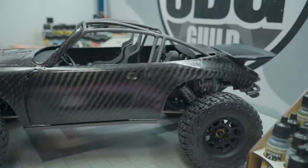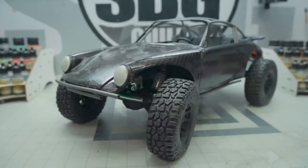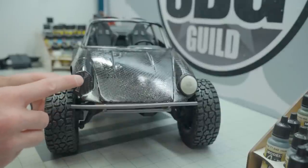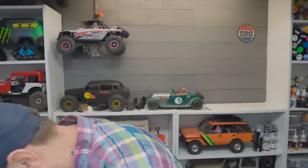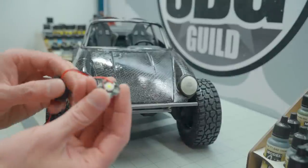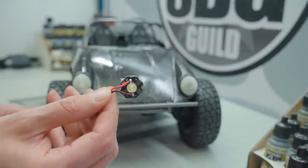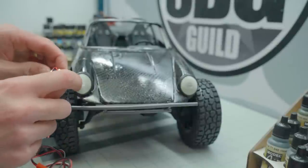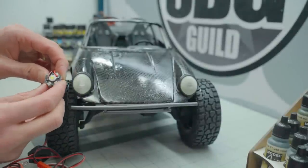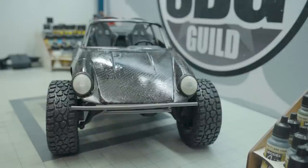Josh designed the bezels and the actual headlight buckets. We're going to have to drill into the carbon fiber — these are just stuck on for now. We're going to place the Incision LED light kit, or at least the fronts. We're kind of hacking these a bit — out of the box it's a big, huge old light bucket, but we're trimming it down to just the actual LED and the heat sink. We'll drill a hole so this section comes through and we'll glue it in from behind with some metal JB weld, as long as it's not conductive — which I don't think it is. The headlight will shine right through. These are on 3S as well, so we can just wire them directly in line with the battery.